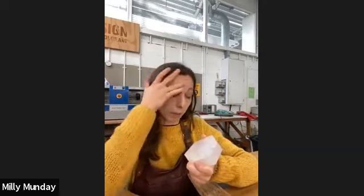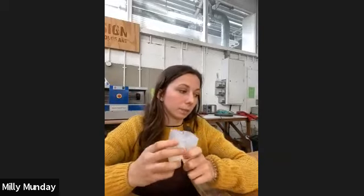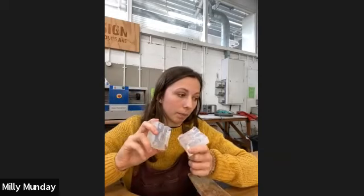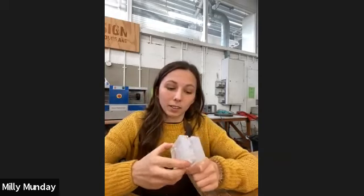They could also be good for organic models if you're getting impressions of that. And they can also be good for very delicate, fine work. If there are really tiny little bits of wire and small pieces of jewelry that have the possibility of melting in the vulcanizer, then it is a cold mold that you're after. Another good pro with the cold mold is there is less shrinkage. There's minimal shrinkage with a cold mold as opposed to a vulcanized mold. And it's good for complicated, more complex models.